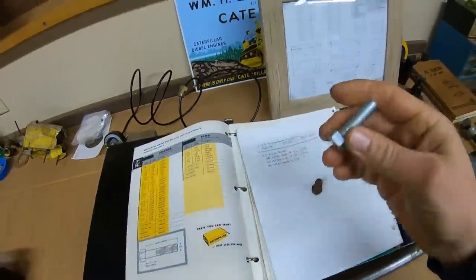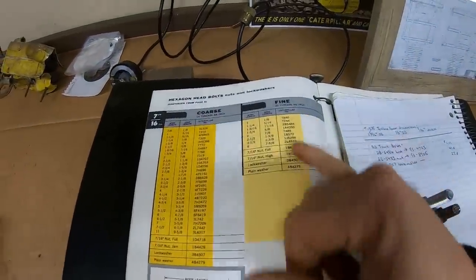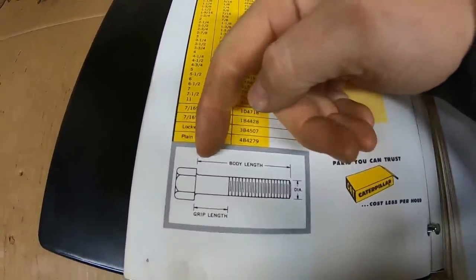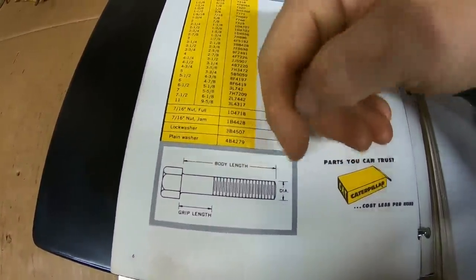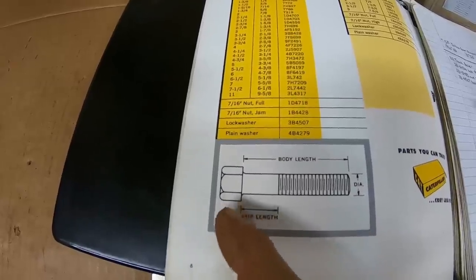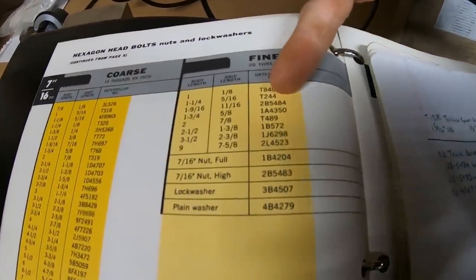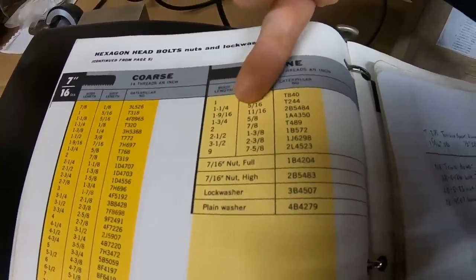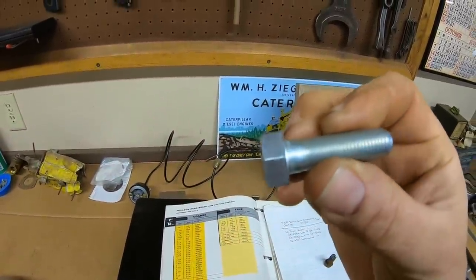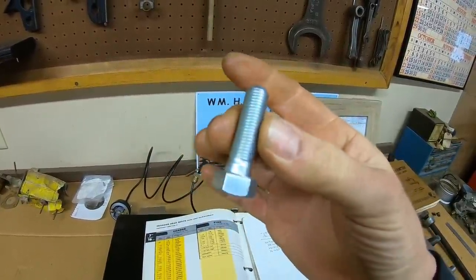The first material difference showed up in the new bolts. The bolt selection guide lists all the part numbers and gives a breakdown of how the bolt should be constructed. Body length is everything from the base of the head all the way down to the end of the bolt. Grip length is any unthreaded portion between the base of the head and where the threads begin. For the 2B5484, it should be a 1 and 9/16ths body length with an 11/16ths grip length. Body length is appropriate, but grip length is not — that's maybe an eighth of an inch effective grip length.